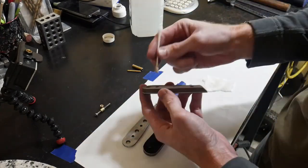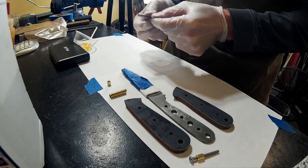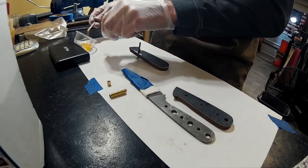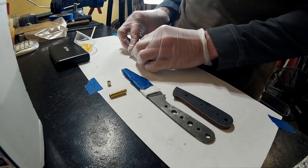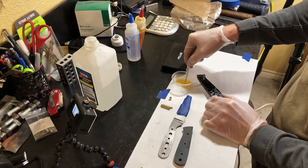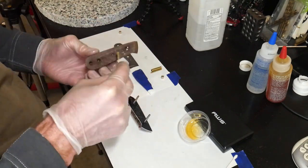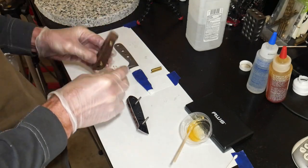Next we move on to the glue-up. The first step is to clean all your components so that the epoxy has a nice clean surface to adhere to, including the inside of the counterbores. I put a little bit of epoxy on the head of the Loveless bolt so I have epoxy in the threads between the bolt and the nut, and also a little epoxy inside the counterbore before inserting the fastener. I get both Loveless fasteners installed on one handle scale, then apply epoxy onto the inside of that handle scale and set it aside. On the other handle scale, I put epoxy on the flat inside portion first, then into the counterbores, and insert the remaining two Loveless nuts.